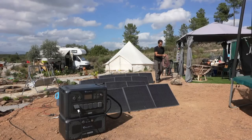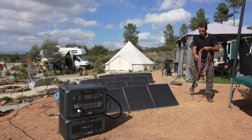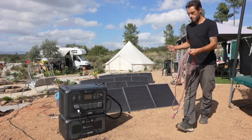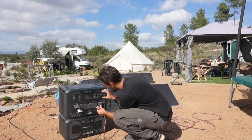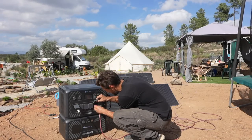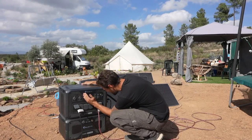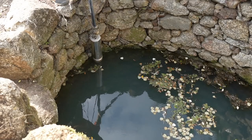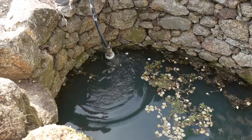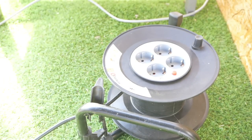It's time for us to do the biggest test so far. In the past, we actually had to go to town to do our laundry, which is not great. But with this power station, we should be able to get our laundry done at home. We need to run both the well pump, which requires about 1300 watts and needs up to 3900 watts to start, and the washing machine, which takes about 730 watts per hour. That's quite a stretch, but let's find out if it works.